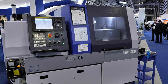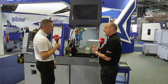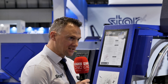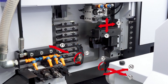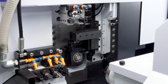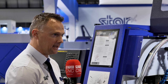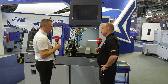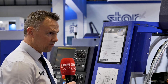And when it comes to the flexibility on the tooling and on the axes, what have you got on here? Does it have a B-axis? Just walk me through the configuration. So there's no live B-axis like we have on the higher-end machines, but because you've got all these tool positions, you can put other tool holders in. For example, this machine's got a face milling unit, a slotting unit — there's all sorts of different tool holders you can put in there to make it as flexible as possible. And the cost is an important factor — it's giving customers access to a decent machine with lots of tool count, without having to spend as much on the higher-end models.